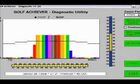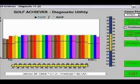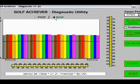After the base laser is aligned on the post sensors, we will select the refresh button in the diagnostic program to update the current sensor values. After the refresh button turns green, we must select the calibrate button for the Golf Achiever 2 unit to have maximum threshold values, represented by the horizontal black line through the graph.